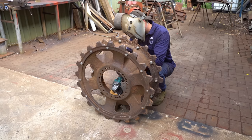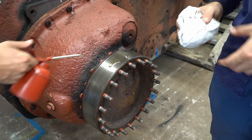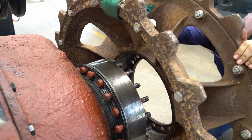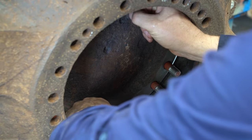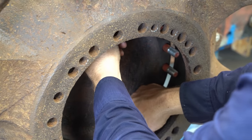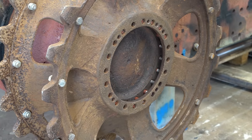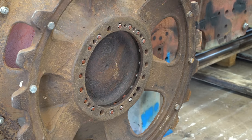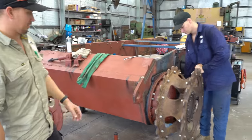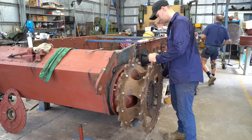To take a little bit more off, I think. It's running down the center, see, not to the side? It's just dead level. Nice. Like a glove. Too tight. Tested it, spin it around. Put a dial indicator on it. We'll get it to within a thou. That's why you keep spinning it. I'll just run the dial indicator.